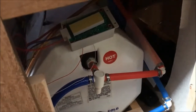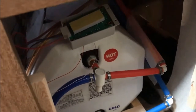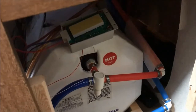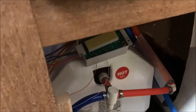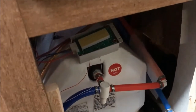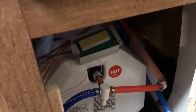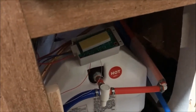It was literally a case of taking out two screws to take that whole mounting bracket off, carefully removing the wiring, and then reconnecting it. One tip I'll give you: take a photograph of the wiring so that when you go to put it back together, everything's where it should be. That way you know everything is going to be working just fine. What I need to do here is carefully maneuver that back into position, put the screws back in place, do another quick test of the water heater, and then put everything back together.